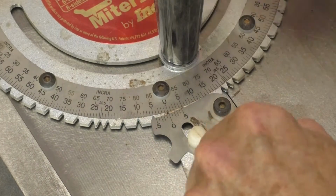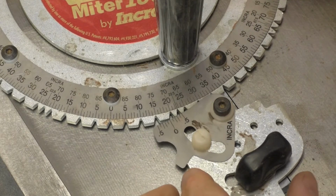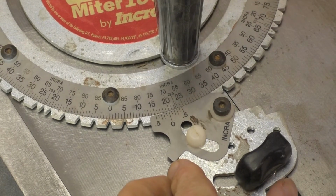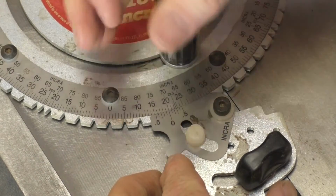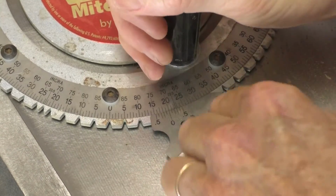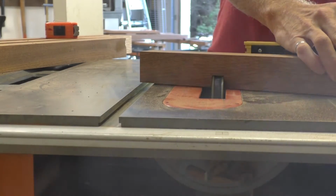In my original sketch, I was going to use a 30-degree angle for the top piece. So the purpose of the top piece is to protect the light from the weather, from rain and snow, but also to provide a reflective surface for the LED light that's going to shine up on it. But I changed my mind and I went with a 20-degree angle.